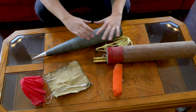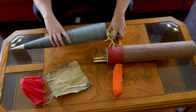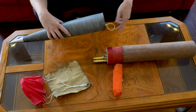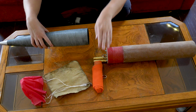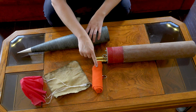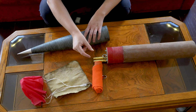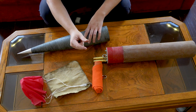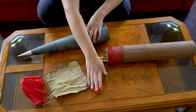So before you is all the recovery gear for this rocket, and the same setup will be in the N1000 project. As you can see, the main parachute, which is right here, this is a 50-inch Top Flight thin mill. I think I'm going to go to a bigger chute with the actual N1000, so this is going to be just a little bit different, which, if you want to get technical, defeats the whole purpose, but really what we're focusing on here is the cable cutter system.